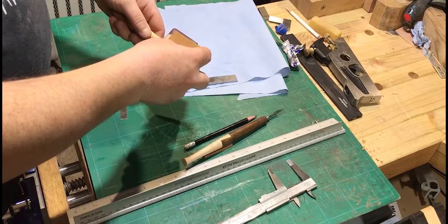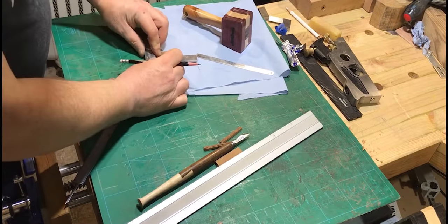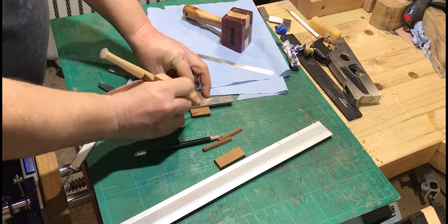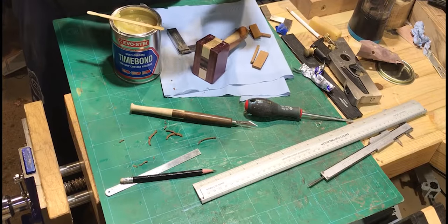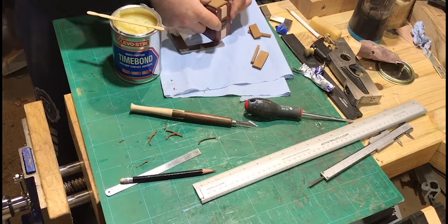Lastly, I'm adding the leather end that goes on one end of each mallet to aid assembly — so you don't actually damage or dent the wood when tapping it together. The leather is cut to size and glued in place with the contact adhesive. Very quick, very efficient.